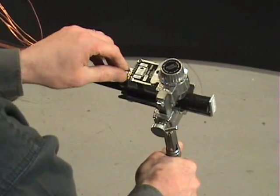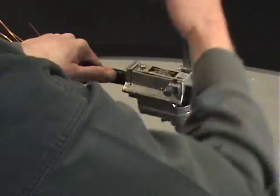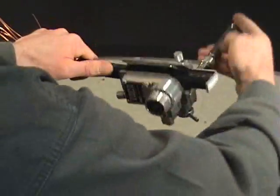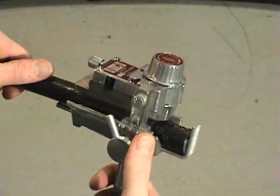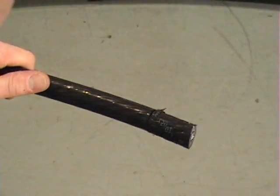When not using the accessory or when stripping a larger conductor size, you need to move the blade lever to the square cut position to square off the cut. Open the jaws to remove the tool and cut insulation from the cable.